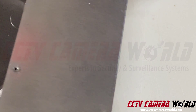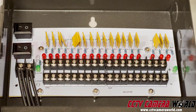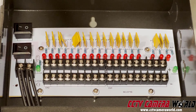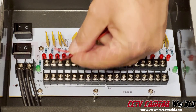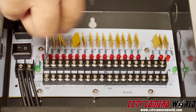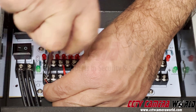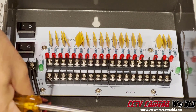On the power boxes, there's usually a punch-out hole. You can punch this out using a screwdriver and then thread the wires out of the power box for convenience. I'm just going to show you how to connect these properly. The bottom is negative — that's where the black one connects — and the top is positive — that's where the red one connects. Make sure you have enough wire spaced apart, unscrew the terminals using only a hand-driven screwdriver, then make sure the cable is secure and tug on it to confirm it doesn't come loose.